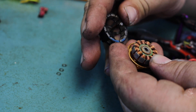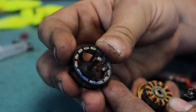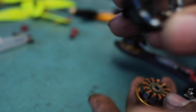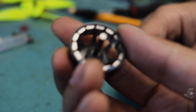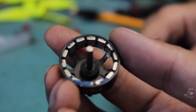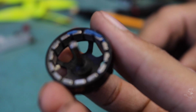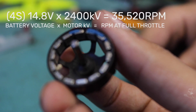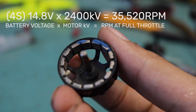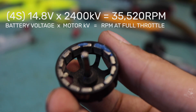So that's what's inside a motor — you've got all your magnets in the bell. The blue epoxy they put in there is to balance the motor. When something is spinning as fast as one of these motors — 35,000 RPMs or so — it needs to be balanced, otherwise you're going to have big vibrations. So they balance each bell individually.